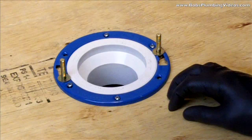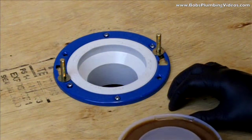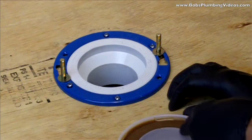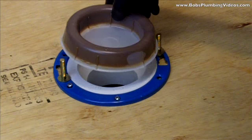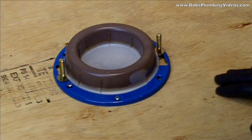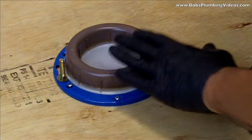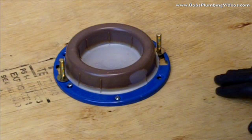I have this covered — I didn't take it out of its cover. Now a lot of guys feel that you should put this on the bottom of the bowl; there's a horn on the bottom of the bowl, a male horn, that they slip this over. All my life I've been putting it on the flange — I set it on the flange like this. There's no right way and there's no wrong way. You can certainly put it on the horn of the bowl before you lift it and put it down, or you can put it down on the flange. This is my preferred method but I leave that totally up to you.